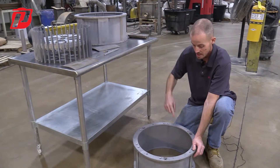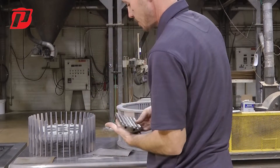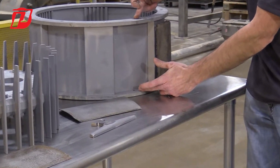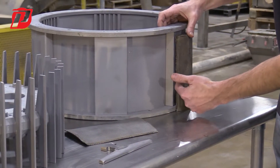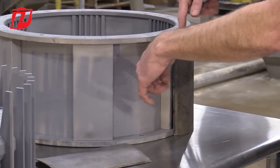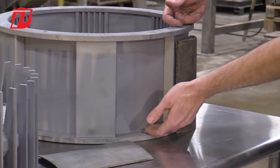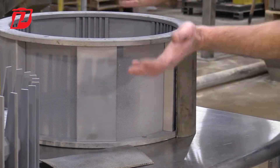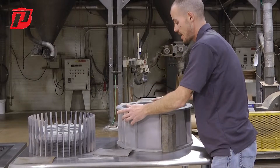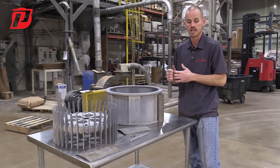It's very important on our ring sieve and our six-jaw or three-jaw to make sure those screens are getting inside those slots. If you're looking at a six-jaw configuration, not only do we have the top part of the screen rings, but we also have the slot inside the jaw as well. The screen — whatever one you're installing — is going to slide in between the slots of the grinding jaws, engage in the bottom part of that ring, and then we put our top ring on, also making sure the screens are engaging in the top ring before we fully lock and tighten them down, so we don't run the risk of pinching or damaging the screens.